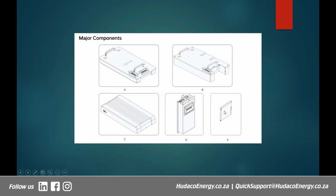And this is the slide cover that I was talking about when I said if you're stacking from 4 modules and upwards, you're going to have some little gaps like this one here that will be on the battery. So you need some covers there to just cover those gaps. All right, so those are the major components of the battery system. Like I said, this slide cover, you don't need it as long as you're using 3 modules. But the moment they become 4 and above, you need the slide cover there.